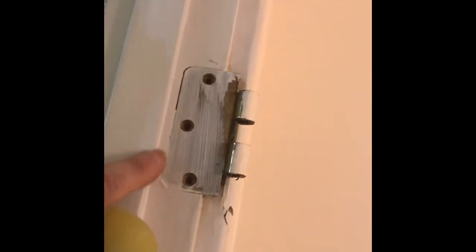So we'll take the hinge off and show you how to do that. Got the door removed and now we're just going to take the hinges off the jamb. As you can see, this one has been painted over, and a lot of times the paint bridges and when you peel it off you wind up splintering the jamb — you don't want to do that because that just causes more issues.